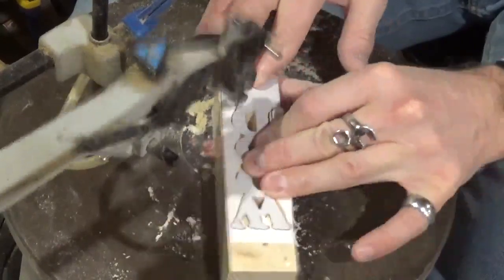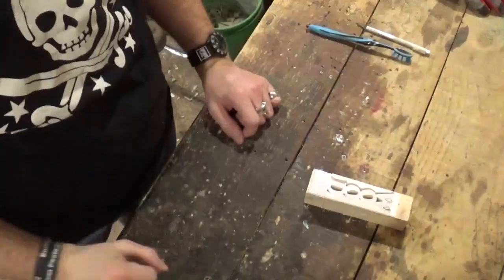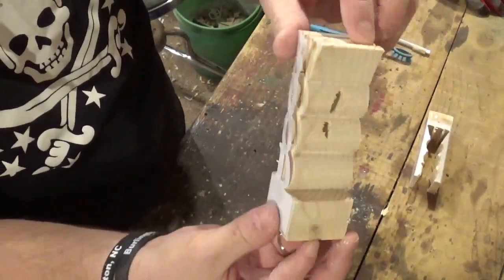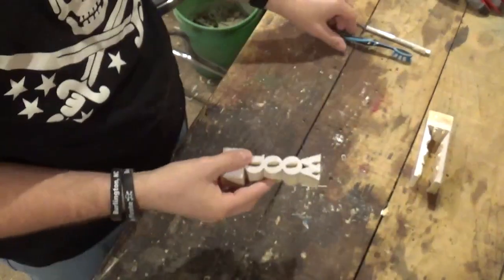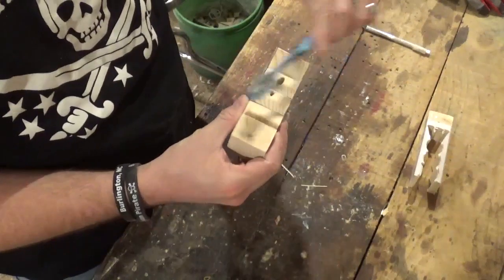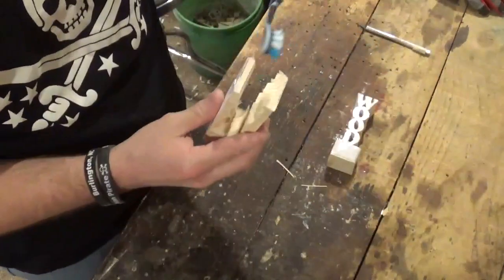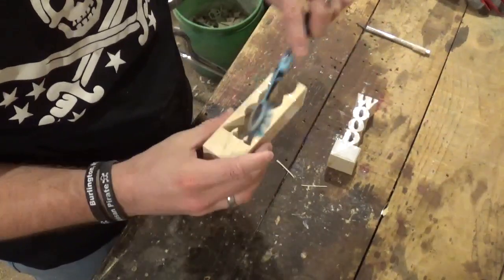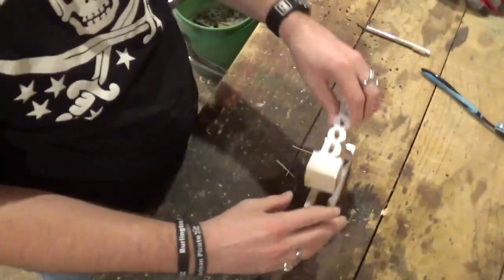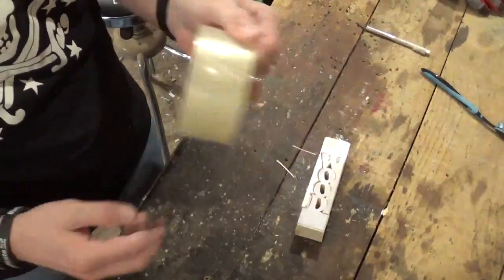When we finish this cut, we'll take the piece over to the workbench. I like to pop the piece out — you can see the internal cuts on the other side — and then I take an old toothbrush, a dollar store toothbrush, and clean off all the dust from scrolling. This prevents that sawdust from catching in the blade and heating up and leaving burn marks on your piece.